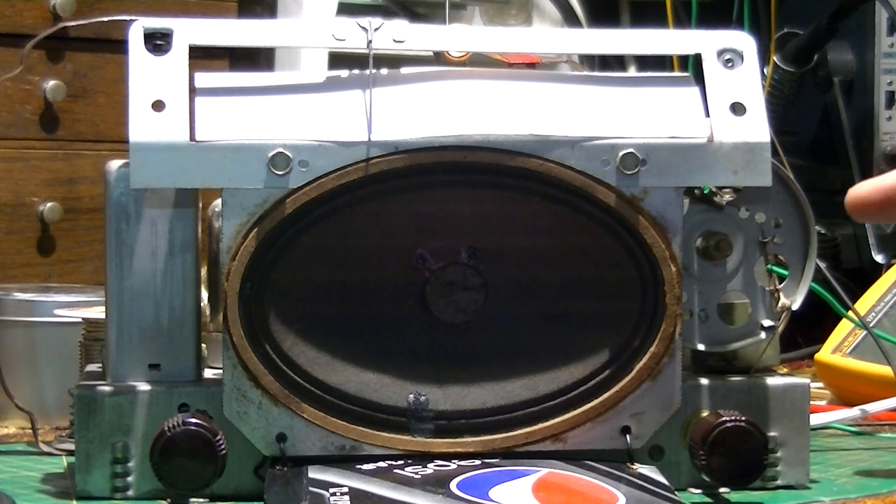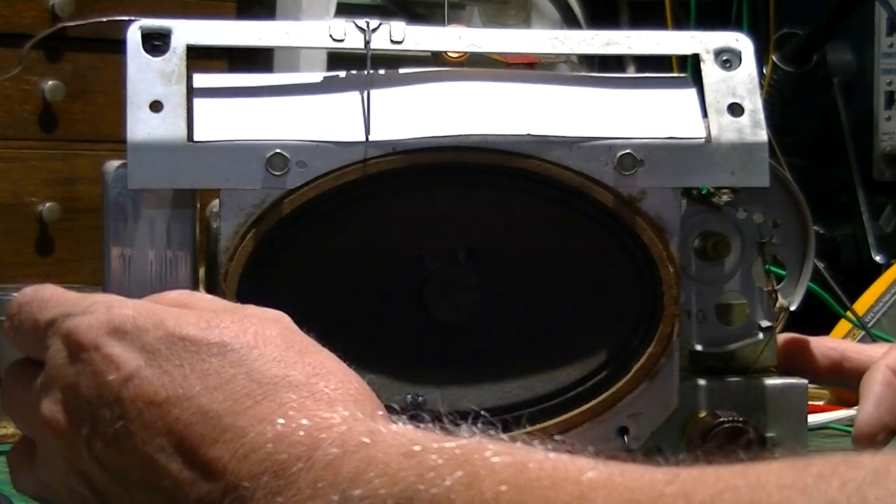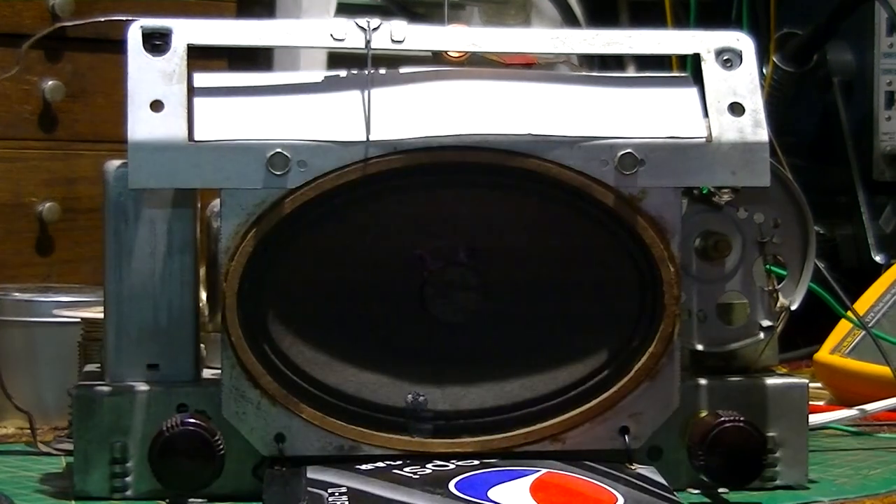I got the new tube in and I did clean out the variable tuner. I took off the mica sheets on the oscillator and the antenna sections, sprayed it down with contact cleaner real good, moved it back and forth open and closed. Then I took the micas and cleaned them with distilled water and a Q-tip, put them back in. I relubed the tuner with some grease in that bearing. Because the lower you go in frequency, the more capacitance you get on the tuning capacitor, so I wanted to make sure the tuner was clean.